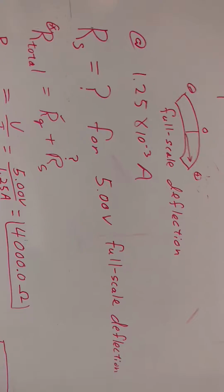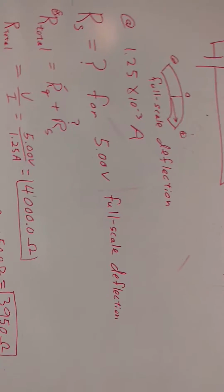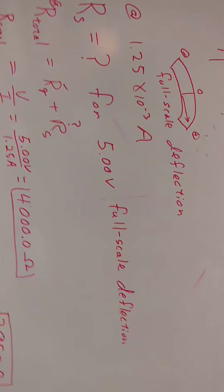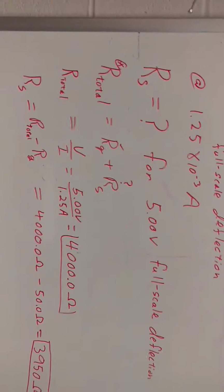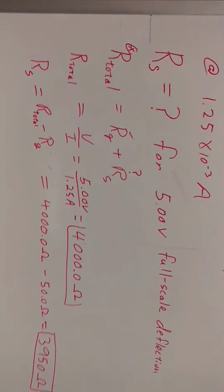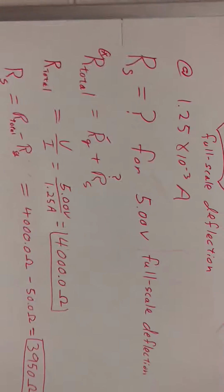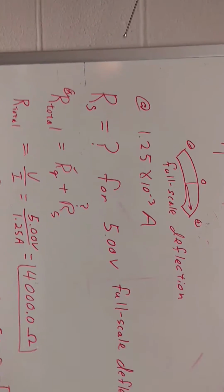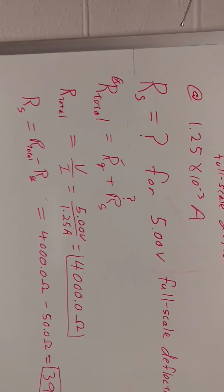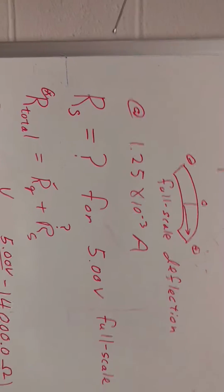So we're essentially saying we want to change this into a voltmeter that has a range of 5 volts of electrical potential. There. Basic application of resistor properties. Again, you did capacitance last week, and had probably already done some things with resistance in different combinations, series and parallel. Unlike capacitors, it's just the opposite in a sense. Resistance in series is just the two resistances added together.